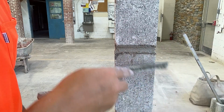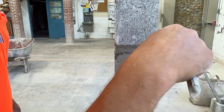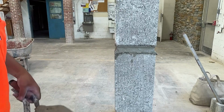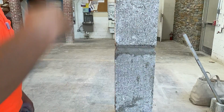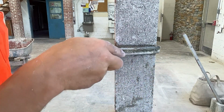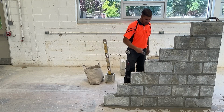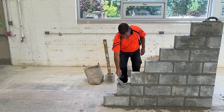Usually, you're not going to see the end of a wall, but we can practice striking up our outside corners. We want these to be concave both ways. And if there's any chips, we can fill them in also. It's just added practice. I'm going to float and then polish. When you're all done the lead, clean off the tail end of the lead. Don't save this for the next bricklayer. It's going to be running in the wall, going that way.